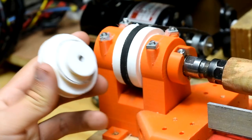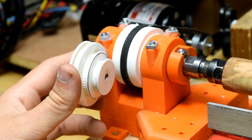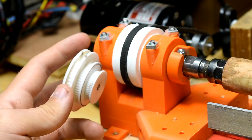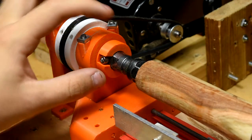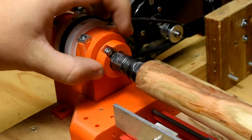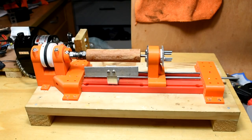While the three tracks looked nice, it was completely pointless and I never used it, so I designed a new pulley that is better suited to the belt I use. Also in the headstock region, I made a safety cover for the collet chuck. I used these larger bolts because I lost the grub screws and thought I may as well make a guard to make it a little safer.